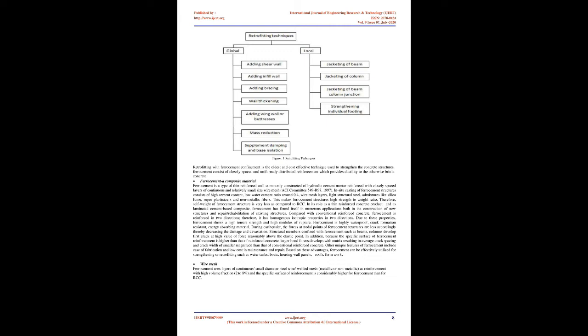Techniques. The column is the most important structural member in any structure, transferring the entire load to the foundation. Reinforced columns in a structure get damaged due to various reasons like overloading, corrosion of steel, earthquake, higher wind loads, fire, impact loads, etc. Therefore, the strengthening of deficient columns is necessary to increase the load carrying capacity and prevent spalling, which can be achieved by confinement of the column externally.